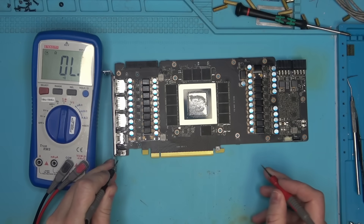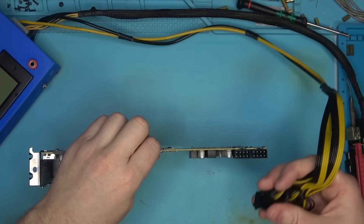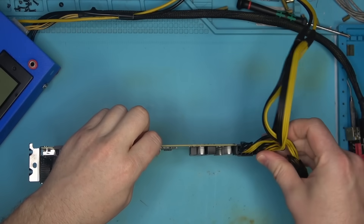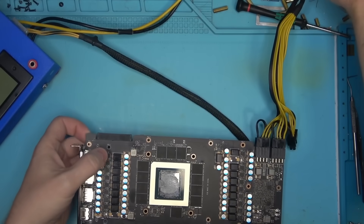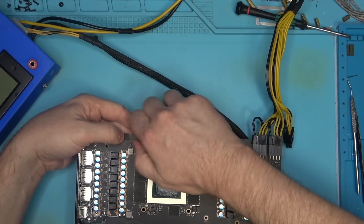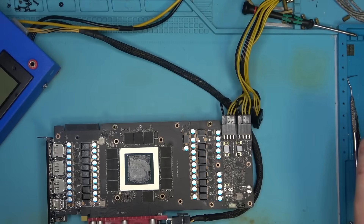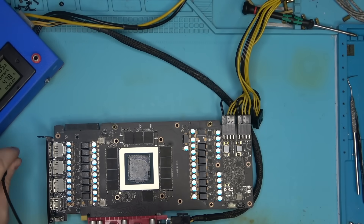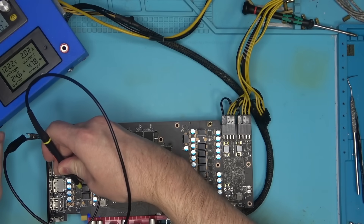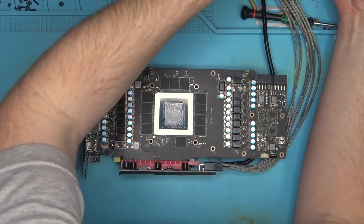The short is gone - perfect. I don't want to boot this thing yet, because sometimes you replace a driver MOSFET and it's still dead but not shorted - not producing any signal, but the card would appear to work and you'd think you fixed it without realizing the driver MOSFET doesn't actually work. That's why I want to check with an oscilloscope and make sure it generates the correct signal, as well as watch the power consumption - almost two amps. The signal looks good, so we have the driver MOSFET working correctly. Let's power this thing on.